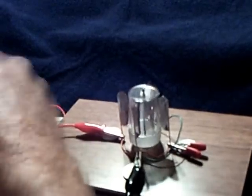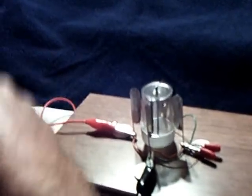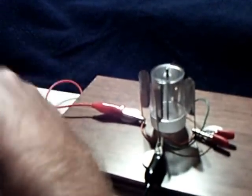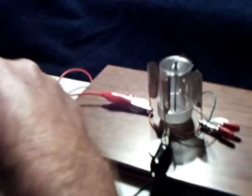I've got to hold the camera away because this high voltage has to be — I'm thinking 20 to 30,000 volts to make this go on my setup. LaserSaber's, I think, works at a much, much lower voltage, but this little thing I built takes a lot of voltage. This is where I want to go now with these electrostatic devices: a motor that has some sort of torque. It also has to have bearings. Thanks for watching.